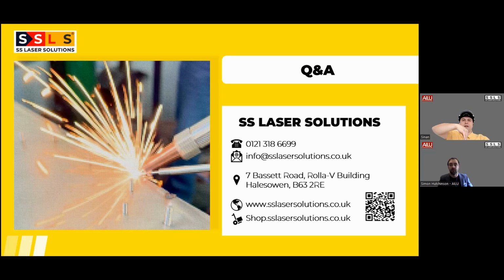But if you keep your angle at 90 degrees, a right angle to the material, any back reflection, especially until you create the first melt pool or weld pool, will be quickly reflected back to the torch, because the biggest amount of reflection is before you create the weld pool. So it happens within a second, less than a second, really. So that's why customers have back reflection problems. They say it happened all of a sudden, because this is light, it happens all of a sudden. So always keep your angle.